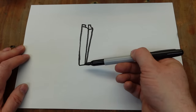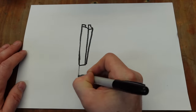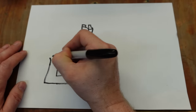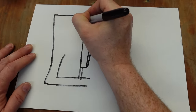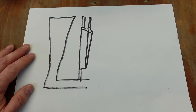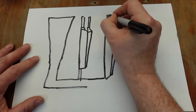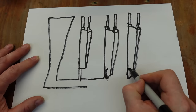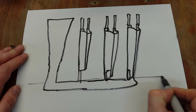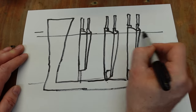My experience with this — I need to make a three-part mould. This is the side view of our switch. My experience tells me that you need to fill the resin from the bottom upwards and let it vent out of the top. Any other way — trying to tip the resin into the top — you end up with just air bubbles in here and it's a disaster. I have a little spout here going into a channel, and from this channel I'm going to have some sort of filling nozzle, with vent holes coming up from here and here. Whilst I'm doing this I might as well mould a few. So ignoring my mistake, what we're going to do is split them all at this level — it's got to come apart — and probably at this level, level with these. We're going to have a bottom, a top and a middle.